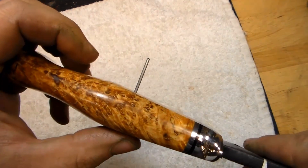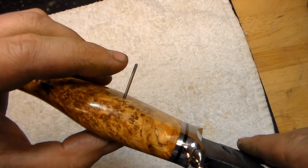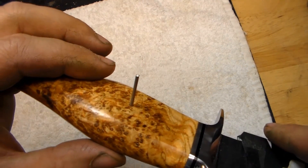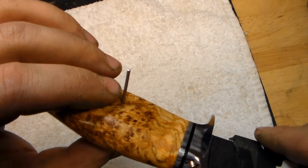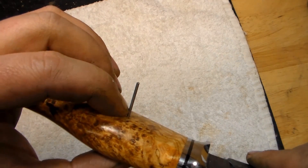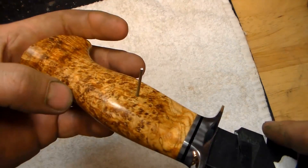Personally, I tend to go almost the diameter of the pin — that amount. These are sixteenth pins, so I'll probably leave about 45 thousandths sticking off each side before I start forming the head on either side. That might not work for everyone, but it works for me and it accomplishes what I want.